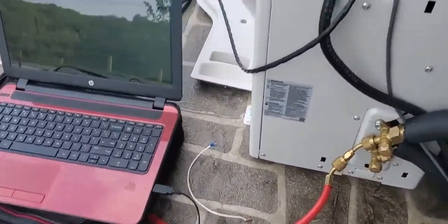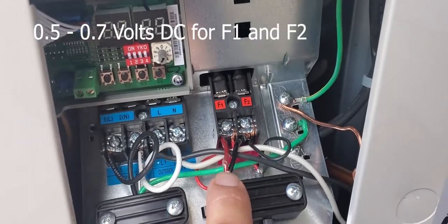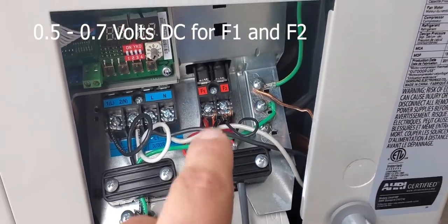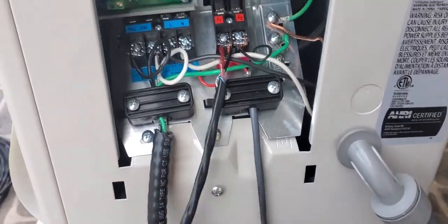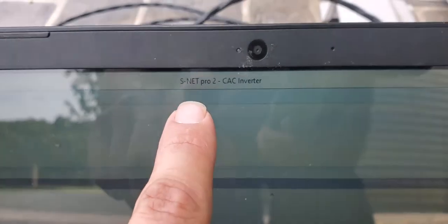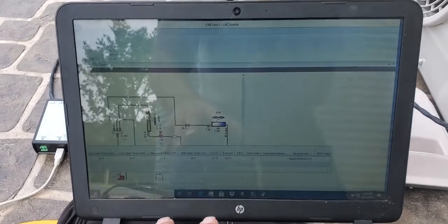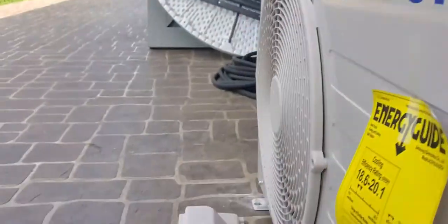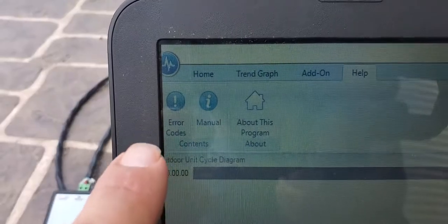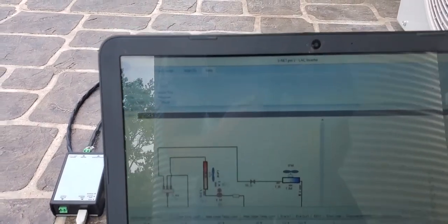This outdoor unit we just installed. I've got a couple wires here that are underneath the terminals for F1 and F2. F1 and F2 is 0.5 to 0.7 volts DC communication voltage. The reason I've got these two wires hooked up to my S-Net converter box is because I'm using a program called S-Net Pro 2 to check all the parameters and make sure the unit is running properly. If I have an error code on my display, I'm able to go to S-Net Pro, look at my error codes from the help tab.